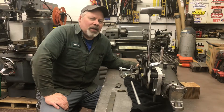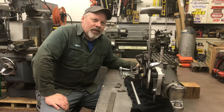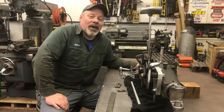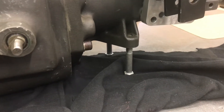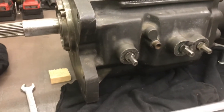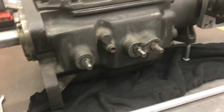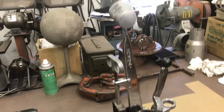When I build a shifter, it typically takes me a solid two days. Is it worth the effort? Yep. Are you working for pennies if you sell it? Yep. But that's okay. The first thing I did after yesterday's video is find a couple of seven-sixteenths bolts to screw into the tail housing where the mount would go — that lets it sit solid on the bench. Otherwise, you're going to chase it non-stop. I initially had just a wedge shoved under it, but that didn't work out. And then in my box of goodies, of course, this is a beautiful shifter — the T-handle doesn't match, it has a couple of nuts on it.